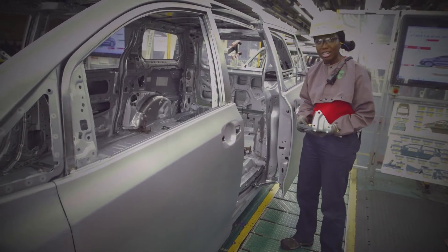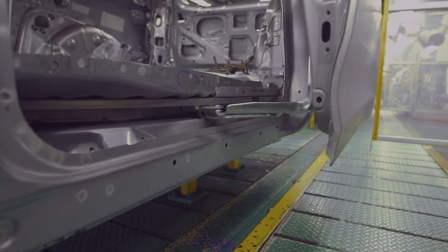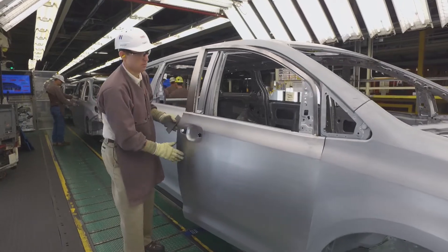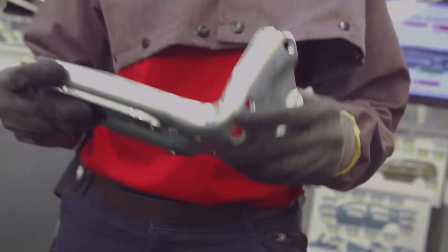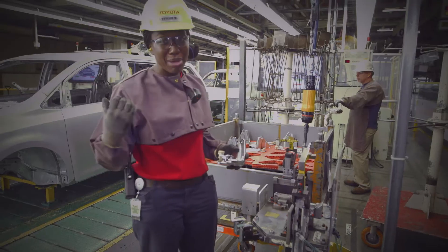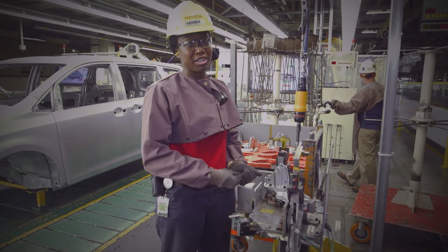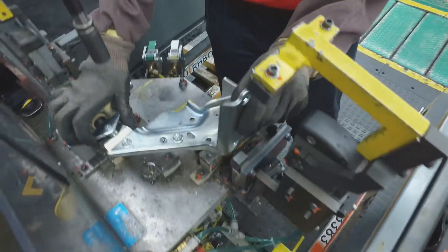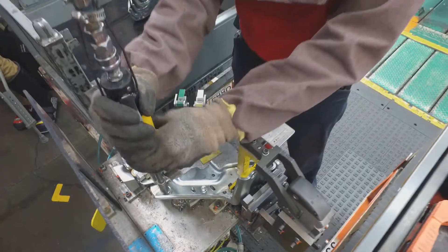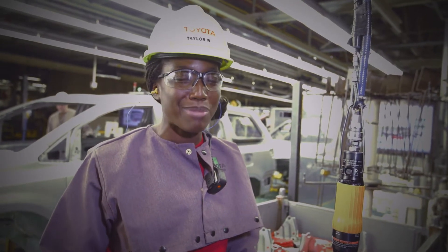This right here is the lower roller, and the lower roller sets how far outboard or inboard the door is. Being in Body World, we care a lot about body fit — we want the body to fit the same way over and over again. To improve the repeatability of this part, I created a jig. We were able to determine the repeatability was not at the level we wanted based on a math formula. I automated these clamps to make sure that this part is going to be set in the same location every single time. Math and science — we use it all the time around here, and I'm so glad I made a career out of it.